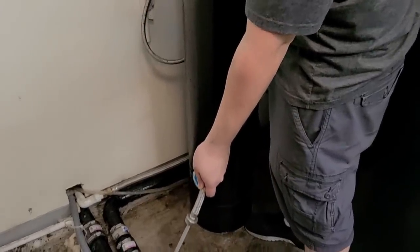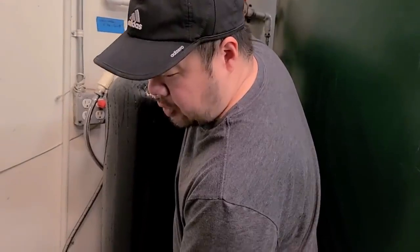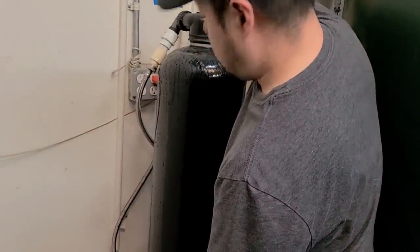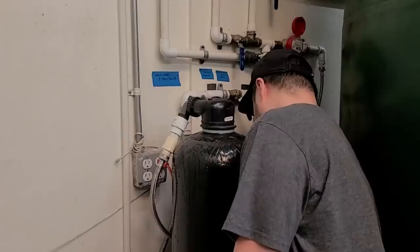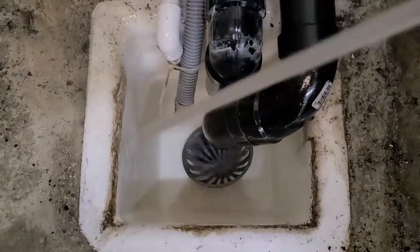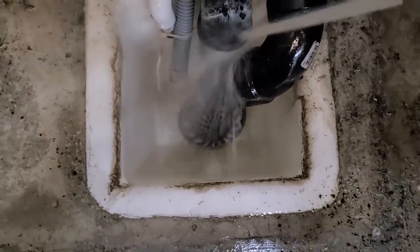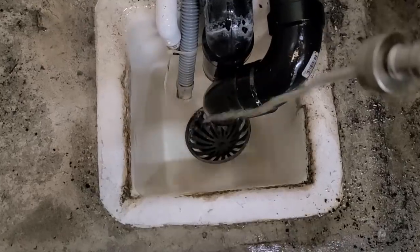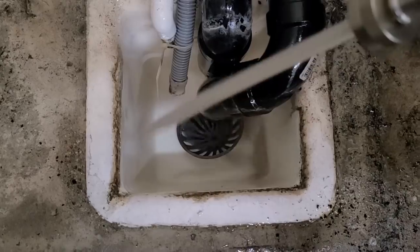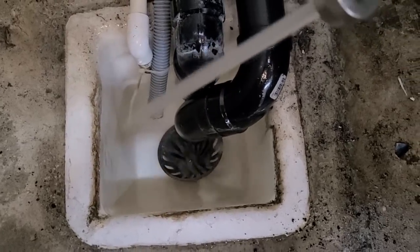I have to make the pressure strong so that it flushes the carbon. It doesn't look very dirty at first, but the water is going so fast there's probably a lot of fine particles being flushed out right now. See — the water is coming out dirty now. It's brownish. At the first flush it wasn't dirty, but now you can see it. More dirt is coming out — oh my goodness. Look at that. So my suspicions were correct. There is a lot of dirt that has been trapped inside this filter. I'm just going to keep backflushing it.